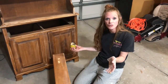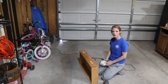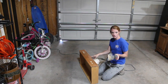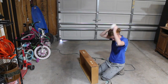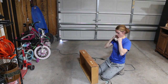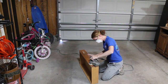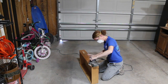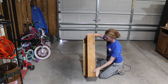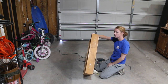As you can see, the filler is really dry and ready to be sanded. I'm using 120 grit — that's also what I used for the scuff sanding. I'll sand this down nice and smooth. You can see it filled the holes really nicely and it's perfectly smooth. We'll clean it again and then get started with the first coat of paint.